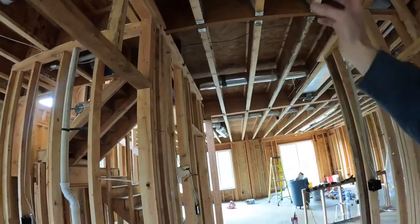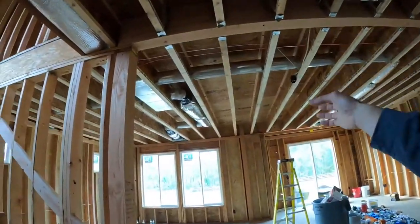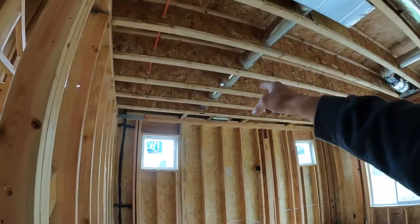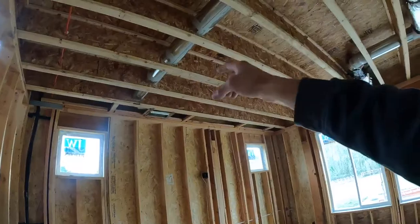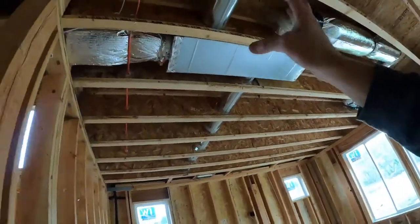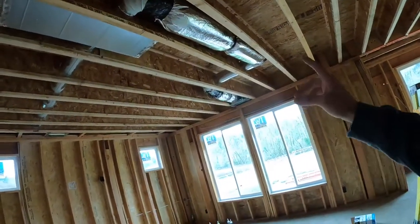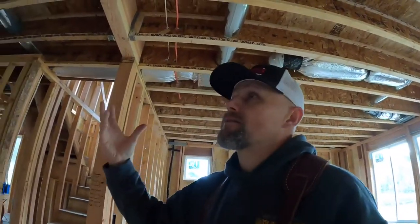I might end up checking on insulating the floors in here for sound. There might be some sound issues, but that would probably be more towards the supplies down here — those would need to be adjusted at those supplies because there's no access for anything around here to dampen and restrict the amount of airflow to one and increase flow to the other. Those dampeners would need to be at those sources. Up in the attic you can have access to that, so that's where they should be.